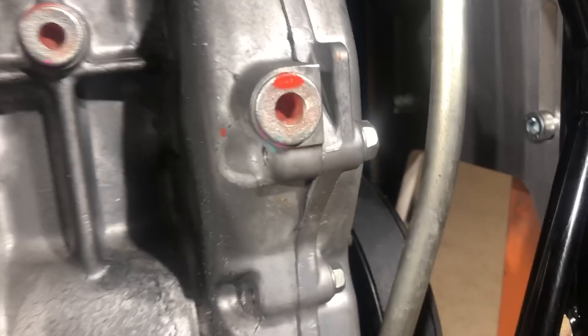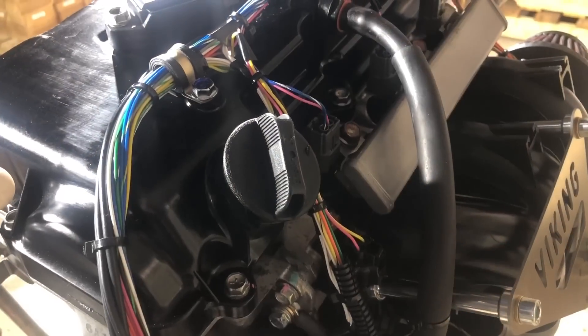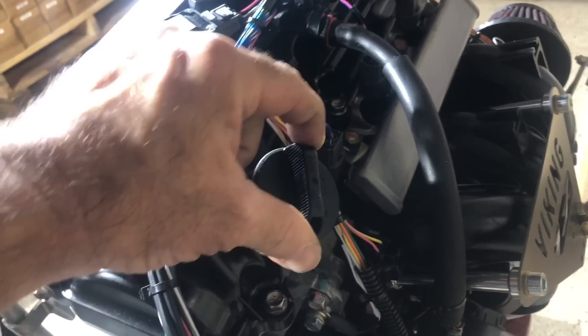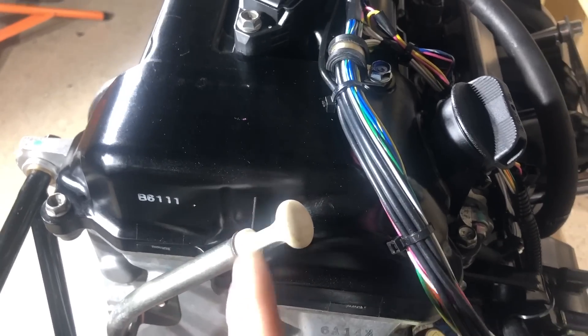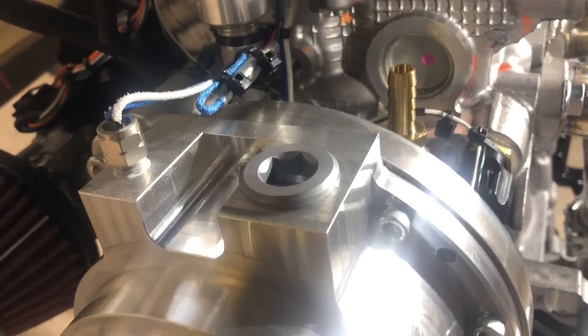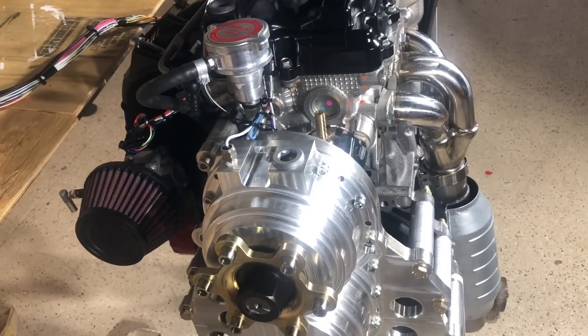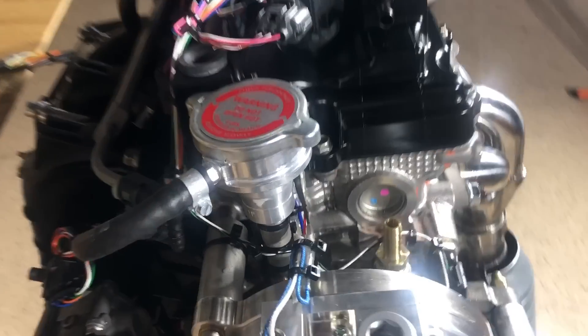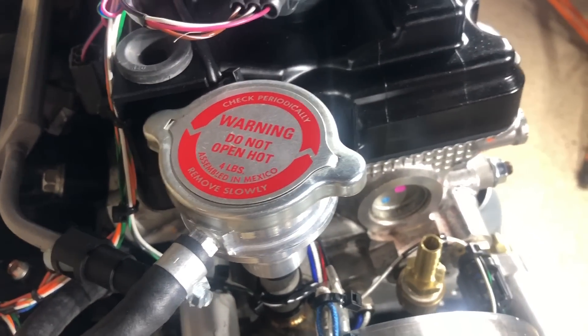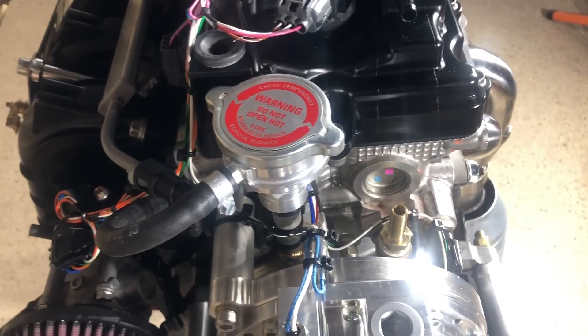Here's a port that could be used for oil-related accessories, such as an oil pressure switch for an hour meter. To service the engine, you install three and a half quarts of synthetic 0W-20 oil, with a dipstick provided. The gearbox gets Mobil gear oil 75W-90 — fill it until you reach the top of the sight glass. Change the gearbox oil as often as you want to keep a good track of its condition. For coolant, fill here using NPG coolant with a four-pound cap and no water added.